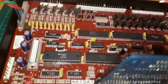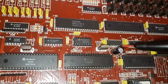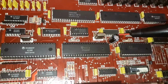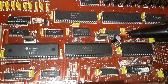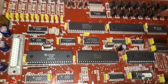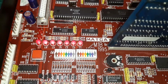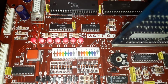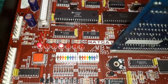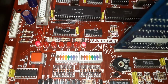Now you can get the board to start again, but very carefully. Try and get it on camera. That's the clear bit of U29, that counter up there. That's just a random counter bit. And if I short the two of them together, a bit like that, see if it takes off. Do it again. Doesn't always work, this. There you go. Now there's the lights doing it again.